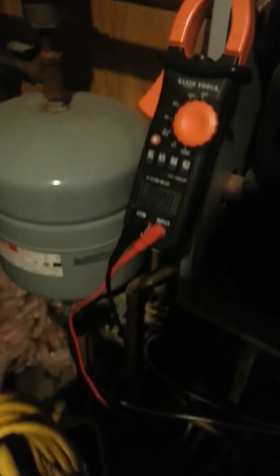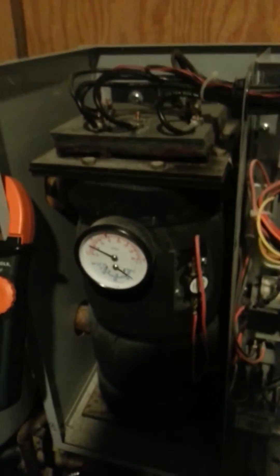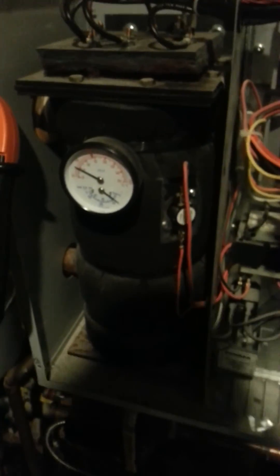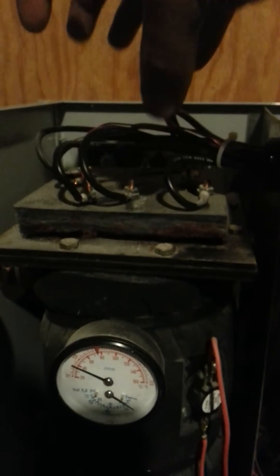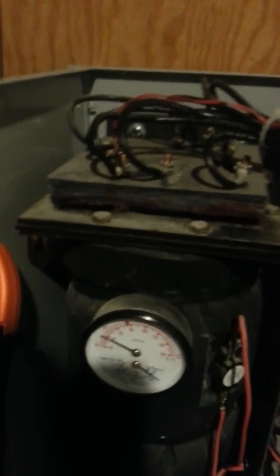Do not leave it like that, because if your pumps quit calling for heat you will overheat your tank and bad things will happen. So we need two new relays. I'm going to shut all my power back off — I got the relays. You can get them from most plumbing stores; just make sure you give them that number. It may be different on yours, but it's a solid state relay. I will replace the relays and see if that repairs my issue. You also want to ohm your elements to make sure they match the specs in the manual or online.